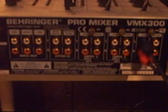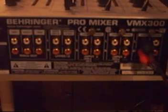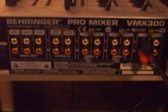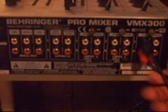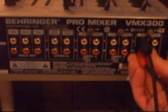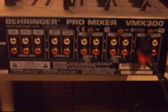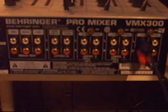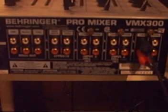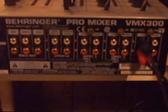very different. The difference, if anybody's curious, is the phono input has a little bitty amplifier inside of it, because a turntable does not have an internal amplifier. A line input does not have a little amplifier inside of it because, believe it or not, your CD player and your laptop or your VCR or your DVD player or anything other than a phonograph has a little tiny amplifier in it. Just so you understand that. Only phono goes in phono.